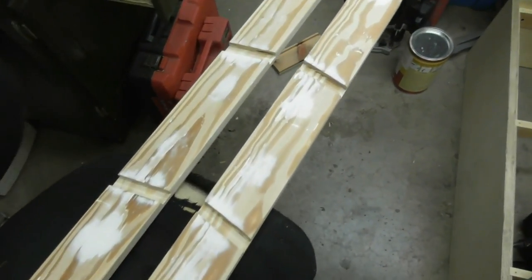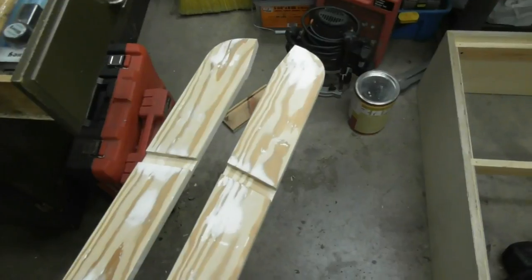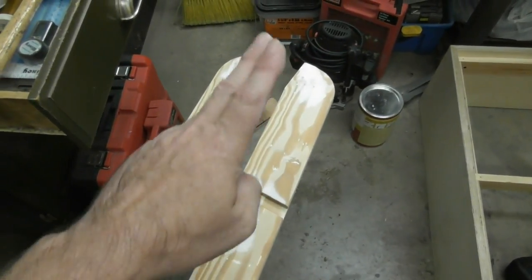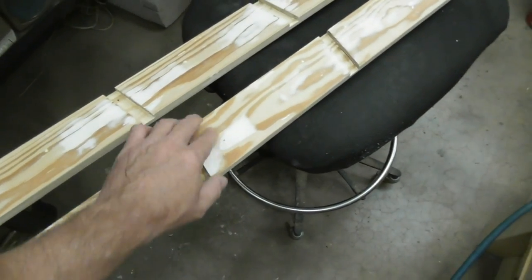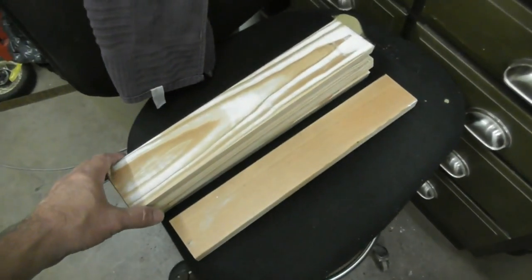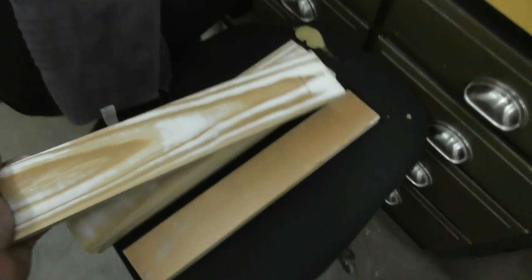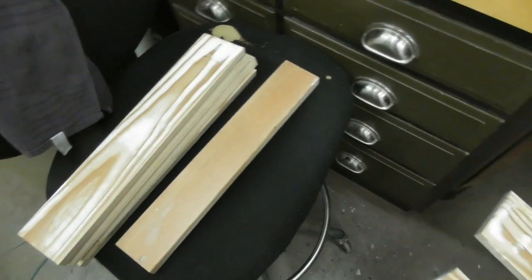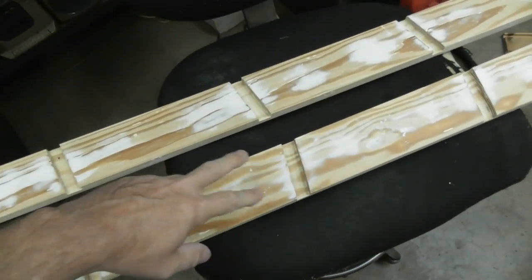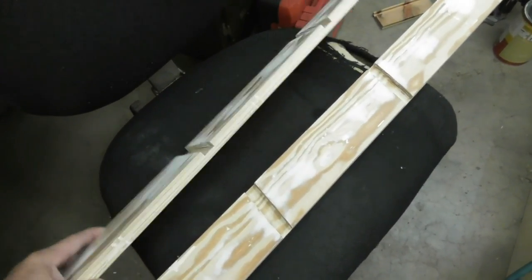The original ladder came up straight on the bed and I really don't like that, especially for small children, so I designed this to have an 80-degree slope — 75 would be more optimum but I needed to hold it closer to the bed because of the door. I've got my dados in here. Over here I've got my stack of treads — same principle, you can see the 10-degree angle on these. I've got to put everything together; I'm going to drill, glue, and screw through the ends. I'm not sure I'll have enough room for a plug — I may just have to fill with rock hard putty.